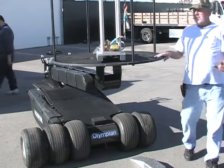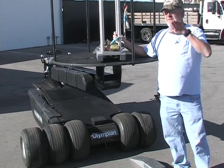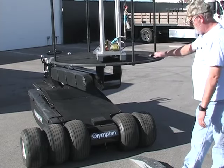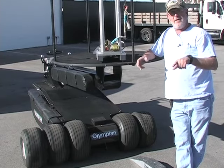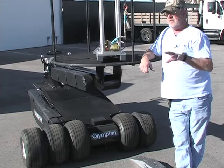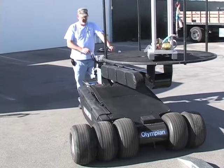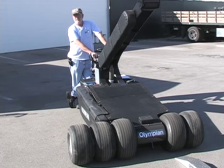When you're loading these cranes on a trailer, always use a ramp and a winch. I really don't need anybody driving them up or pushing them up. The winch is a controlled circumstance for safety and it's nice and slow. Always use a ramp and a winch. When you pull it into the trailer, always lash it down to the chassis. You have a ratchet brake that you can set for parking for a moment until you strap it down, then release the ratchet lock brake. We do not want it on during traveling. You turn the pump switch off and take the arm up and down until you've exhausted all the hydraulic pressure out of the arm.